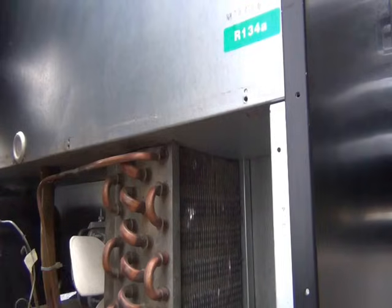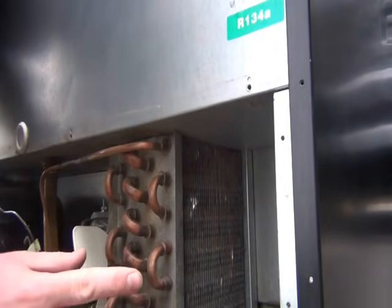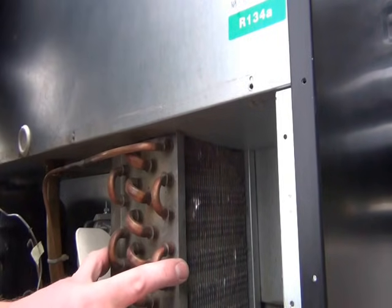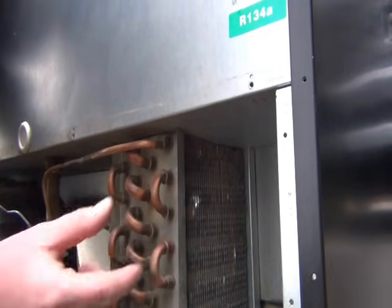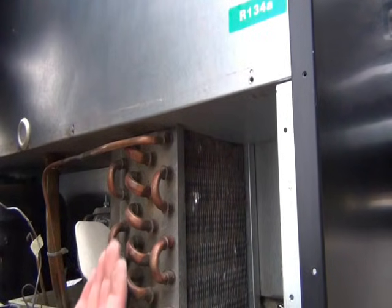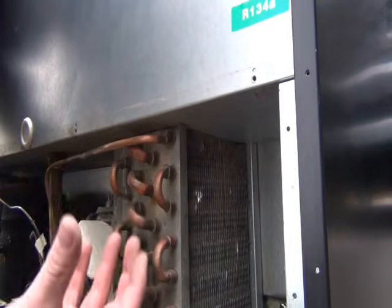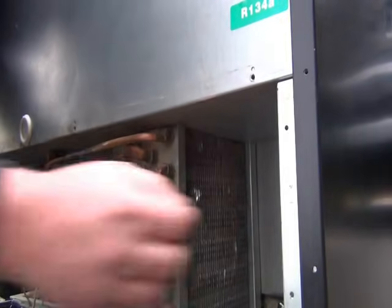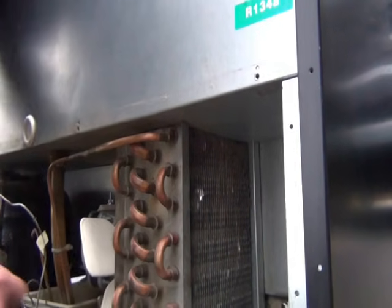Clean everything you can see and give it a vacuum out. What I'm going to do is clean this condenser with an air line as well. Because the condenser is thick, it's got a lot of passes inside and a lot of fins in there. We can only clean the front, but dust gets trapped all the way through the condenser. Even though it's been cleaned every three months, I don't think it's been blown out. So I will use an air line to blow gently through the fins and that will remove all the dust.